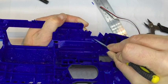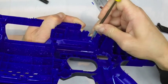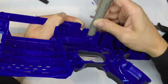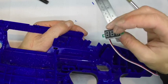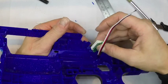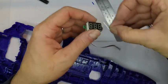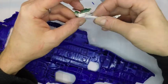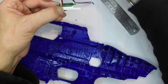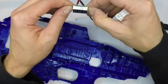Next, find the position of the screw hole for your screw post. Roughen the inside of this area a little bit — even DEVCON likes a bit of roughening, so use your rough file just around the edge of the hole. Remember, the wires on this model are on the same side as the decimal point, so you want it to sit in here with that orientation. You don't want it to just fall through, so I'm going to build a support structure along the side using 4mm strips. These 4mm strips go along the side and hold it in place against the interior of the shell, and then we make a corresponding structure to come over the bottom, acting as a little slot.